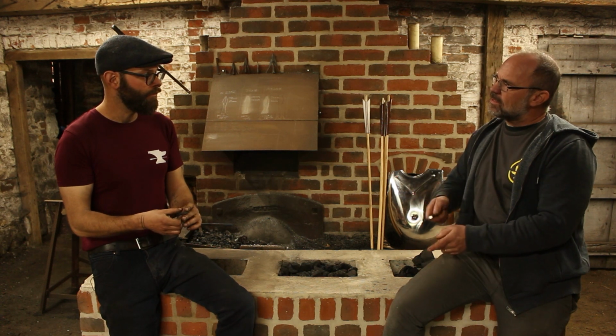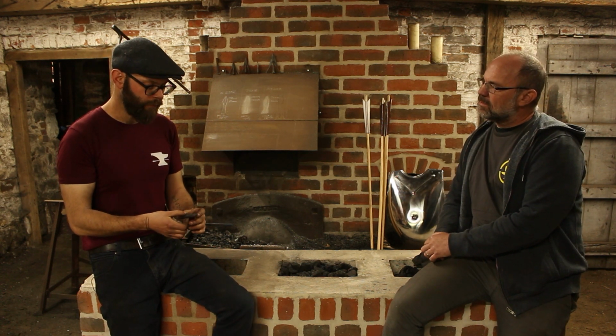And even within that, you have maybe apprentices brazing the barbs on. Yeah, because sometimes welded, sometimes brazed. Yeah, we've got records of both. And brazing is a lot easier, but it takes a bit longer, and they're not as strong. So the higher level smith may well be fire welding those blades on, and the lower level smith will be brazing them on. And that's within a separate entity to someone just turning it around and drawing out a point.